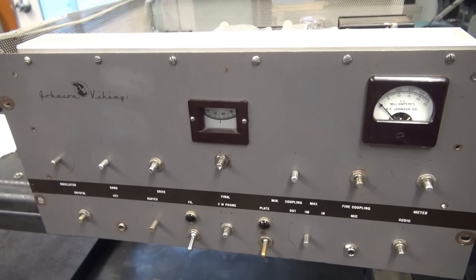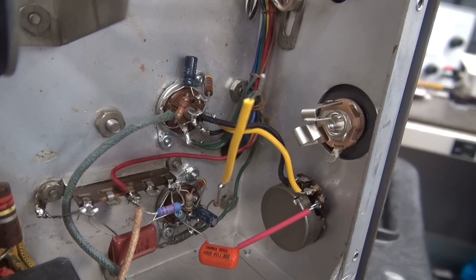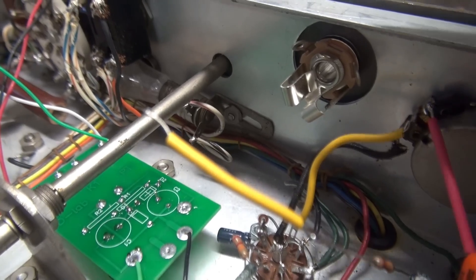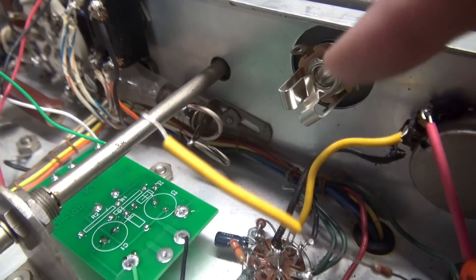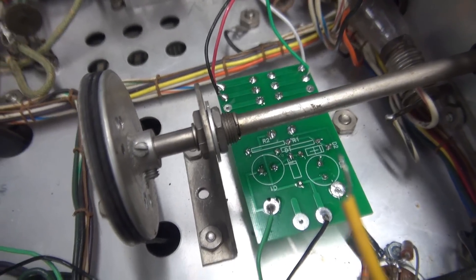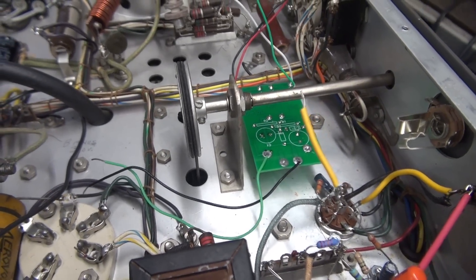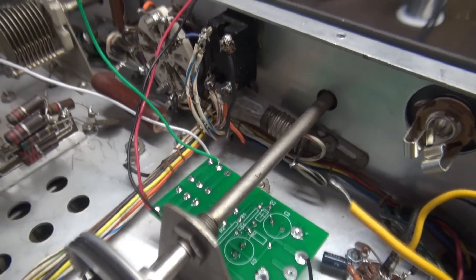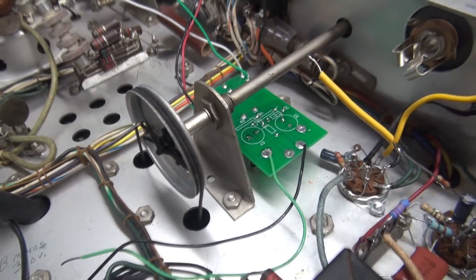I got the front panel on. Let's flip it on its side and see how much clearance I have on that new mic jack — there she is, new TRS jack installed, plenty of clearance, easy to wire. You might ask why put in a TRS jack if you're just going in with audio — the other terminal is for the push-to-talk module. This Viking 1 will get the D-Lab K1 push-to-talk. I've already shown this installation several times in Viking 2s, so I'll just cut back to the final wiring going to the plate switch, the TRS jack, and the wiring to the module.